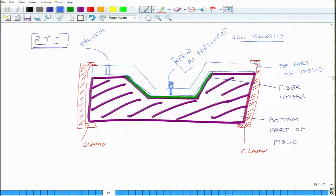This is all about RTM. There is also a special version of RTM known as VARTM — Vacuum Assisted RTM. In VARTM, the process is essentially the same, but you do not send the resin at high pressure. You only rely on vacuum to draw the resin, and as a consequence the orientation of the fibers is even better. You must ensure the viscosity of the fluid is extra low so it flows nicely, smoothly, and wets everything.